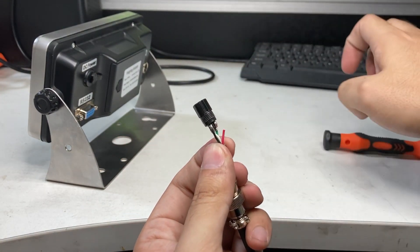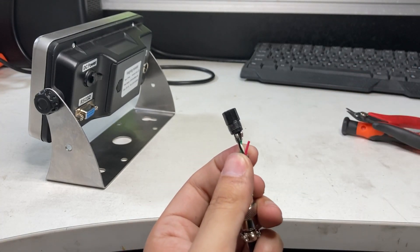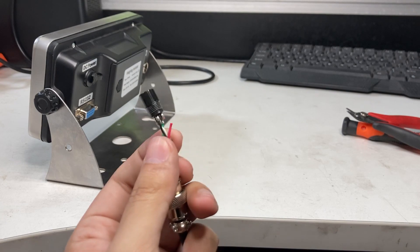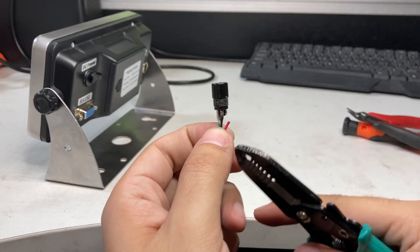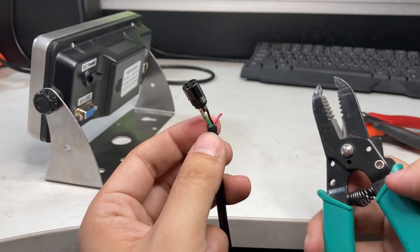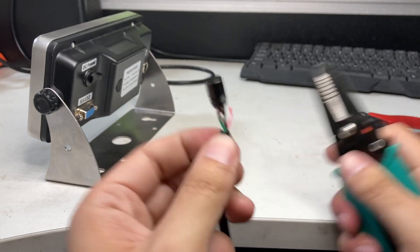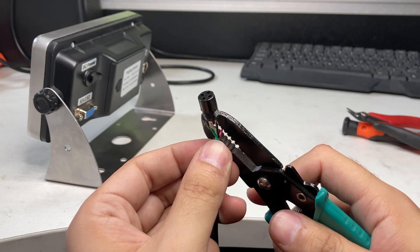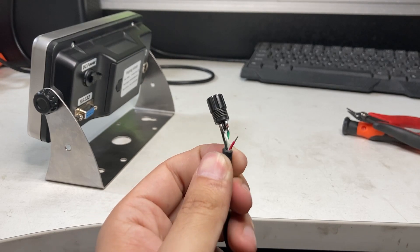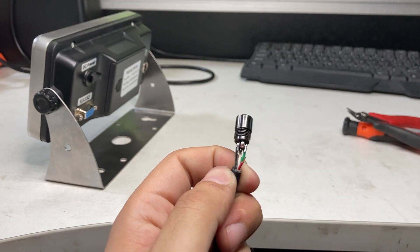You'll cut a little bit and strip the wire. If you don't have a wire stripper, this is going to be pretty much impossible to do, and you'll have to contact support to get a replacement home run cable — if it's a floor scale — or a whole new platform for a vet scale, because you need to solder on the other end. Strip the wire so you have a bare wire, then get your soldering iron and solder it back on.